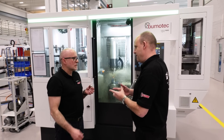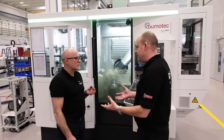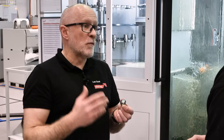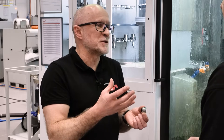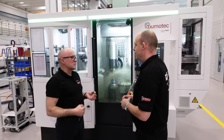Wow — it's 15 minutes to make one of these from start to finish. If I compare that to how it would have been before, there's a massive productivity gain. The cycle time is better, but the real gain is through the automation. From bar, lights out, you're producing these on a drumbeat — you can run this 24/7. You can switch between diameters, because these are a range of diameters up to around 40 millimeters, so there's no changeover time — completely automated machining.